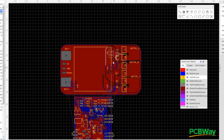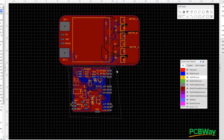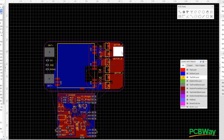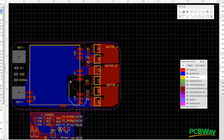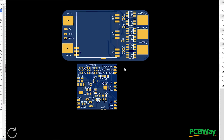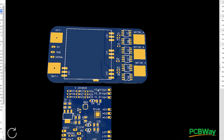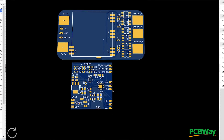Once I receive and fully test the board, there will be a lot of interesting content about ESC design. Everything will be documented on GitHub once available publicly — currently it's exclusive to Patrons until fully tested. The design outputs the voltage sense bridge for each phase and the high/low outputs for the FETs. I've broken out most of the important pads so we can monitor everything with an oscilloscope and debug issues directly.